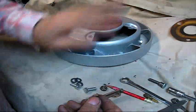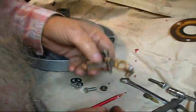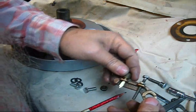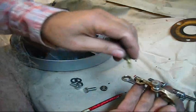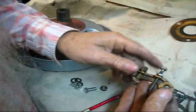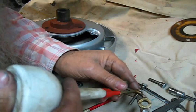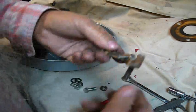The governor is what we're going to install now, and we'll be done with this flywheel. So I just put that bolt right in there. Some of these won't have the threads all the way down — it'll be skinnier down here. Both of them are Maytags; that's the way that goes. We did put the roller in the pin there. This is the part that secures it — that's your RPM, where you set the RPMs by turning this thing. It's got them two little bitty things that fit in that little cross right there, and you can actually adjust this thing down to the accuracy of one quarter of a turn. It's really important that you know the RPM of your engine. Put a little oil everywhere — anything that moves, be it a Model 92 or a Model 72, if it moves, put some oil on it. That's the pivot right there — that's the reason I oiled that.